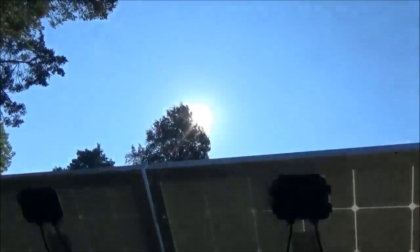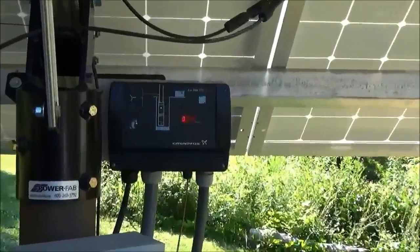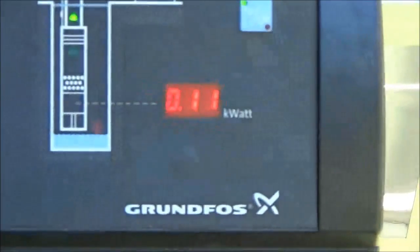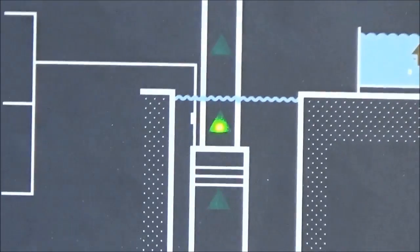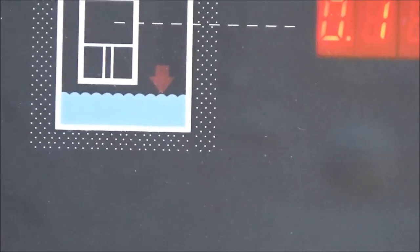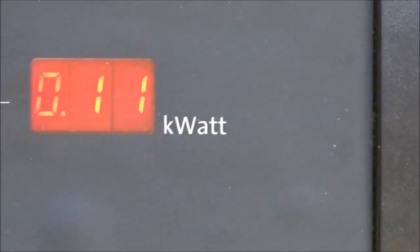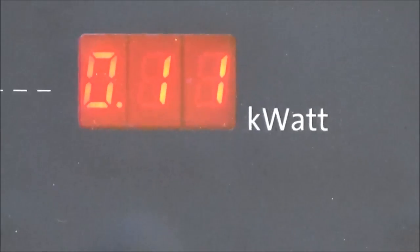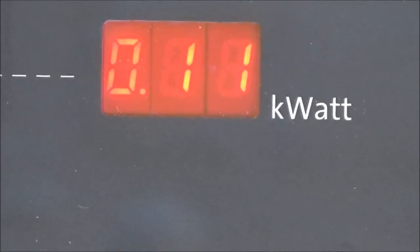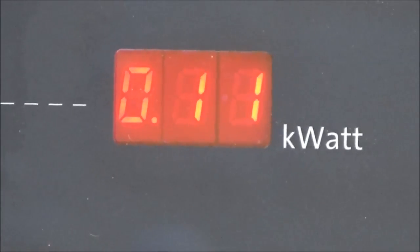We are just clearing the tree and starting to pump water. You'll see the kilowatts come up on the display. We're at 110 watts, and you can see when you're pumping water the indicator shows you're pumping. That indicator shows when the tank's full, and there's another red one if we hit the low water sensor. As we get into the sun more, we're going to see the wattage go up. There's 580 watts max on the panel, and I found this thing runs right around 400 watts really smoothly.